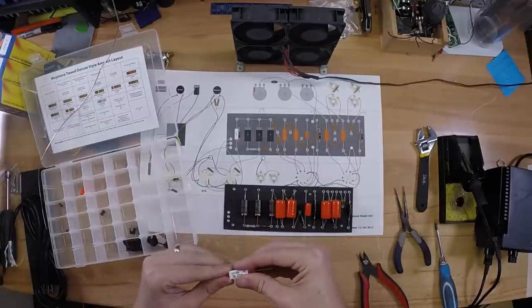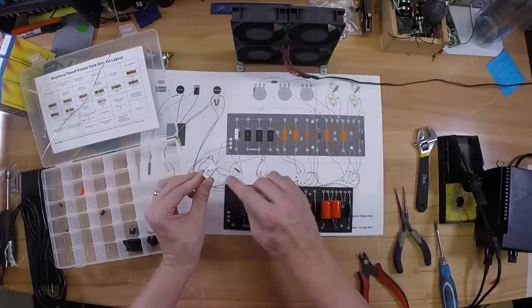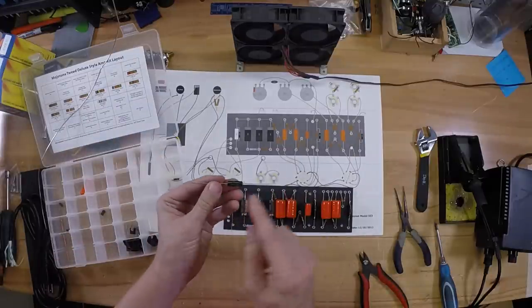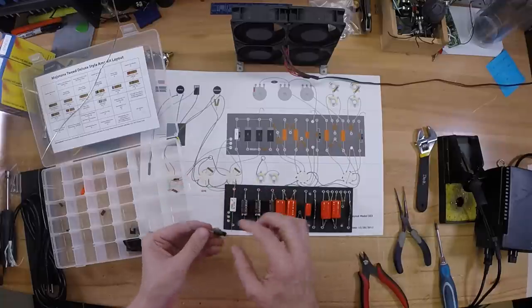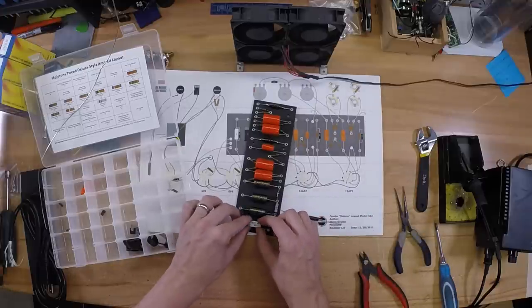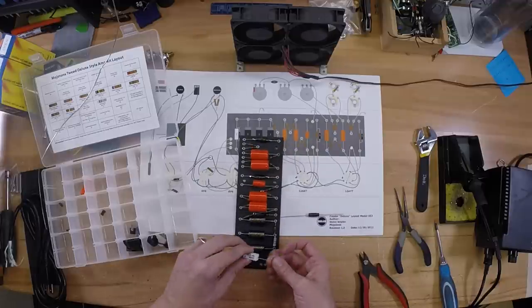And last, on here you have the big 5-watt resistor, and that's going to be your cathode resistor. As you can tell, it's made to put out a lot of heat. But you also have your cathode bypass cap. Because this is a 5-watt resistor and does put out some heat, when you're installing this thing, make sure you give enough space away from the resistor so that it's not sitting right up on it and burning or melting it.